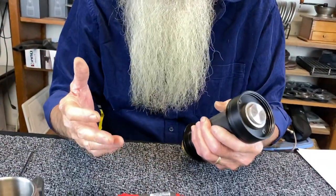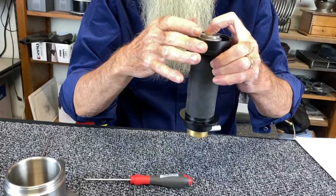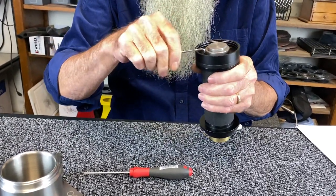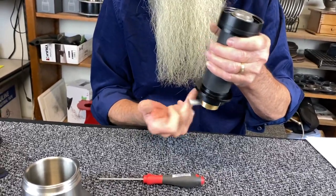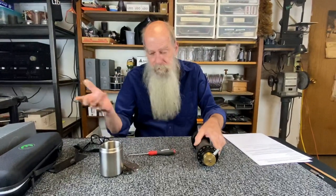So you snug those things up, and that's basically it. Your main alignment motion was pushing down straight here so the cone burr moves the ring burr the small amount it needs to move the Delrin carrier in order to be aligned. Then you come back and check to make sure you tighten these down fully. You can use one of these — you get a pretty good control feeling for the torque. The torque is so light on these it's hard to get a torque wrench to function. You check and it's nice and quiet — it's well centered, well aligned. That's the alignment. In a certain sense it's almost automatic, but when you tighten the screws you have to make sure you tighten them very evenly to maintain nice parallel surfaces between the cone burr and the ring burr. You put the handle back on and you're done.